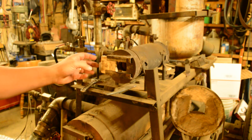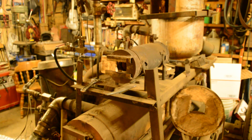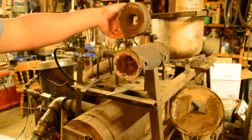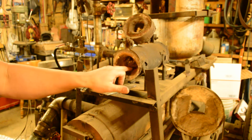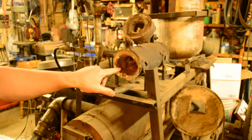fire brick, or this is fire board that I got from, I want to say Ellis Knife Works maybe, or High Temp Tools. They'll sell you not only fireboard, but also the Kaowool or Inswool. There's several different manufacturers of it. And the Satanite, which is the refractory clay powder that you mix up to coat the refractory blanket.